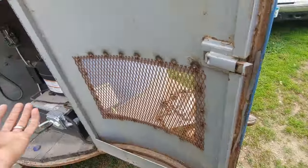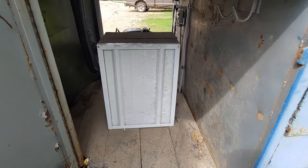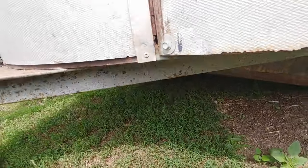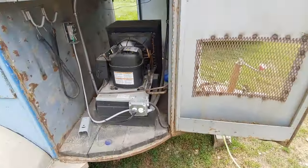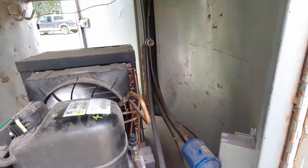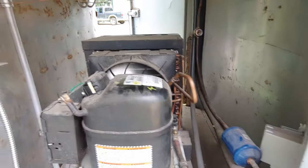They added a piece of grating here for airflow through this compartment. Coming around to the other side, they actually made a cool air intake on the bottom — the coil doesn't look too dirty. It sucks cool air from underneath the trailer, pulls it through the coil for cooling, then kicks the heat out right here. I thought that was kind of unique. The sight glass right there — I don't see anything flowing through it, which either means solid liquid, which I doubt given the temps, or solid empty. I think it's probably solid empty.